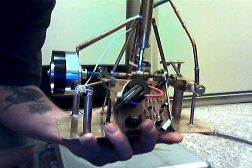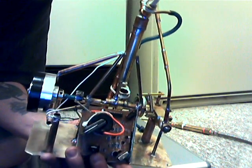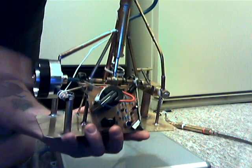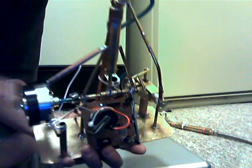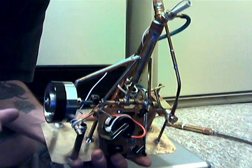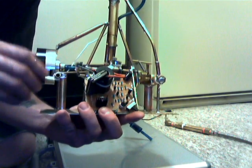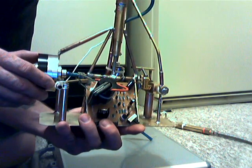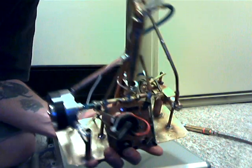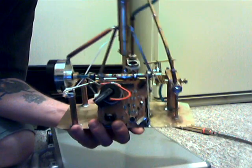I may have to change the timing on this to get it to work like an air motor. I've arranged right now for the intake valve to open just before TDC, which would kind of inhibit air motor behavior. Just based on the way oxy-hydrogen behaves, I thought that would be the optimal way to adjust the timing. The exhaust valve is not exactly right either. So I'm going to fix this timing setup and mess with that a little bit.